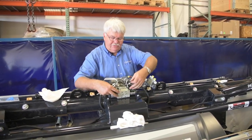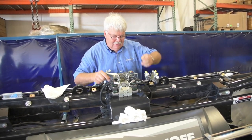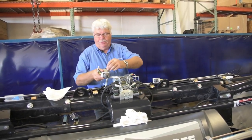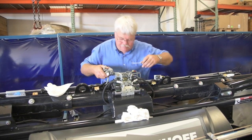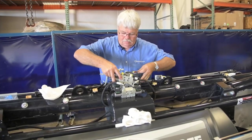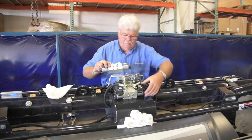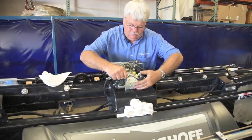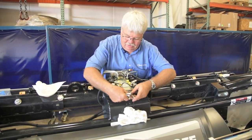We've taken out the four bolts holding the first segment. We'll slide that first segment forward and put the next two loose segments in between. Be mindful that these valve bodies have a recess for an O-ring — make sure you get an O-ring seated properly and that we haven't lost any existing O-rings. Then take the four longer bolts that come in the kit — they're longer than the originals — and reassemble the segments.